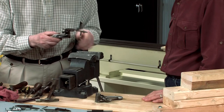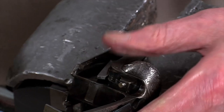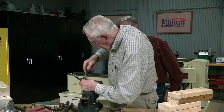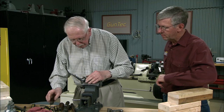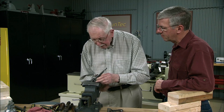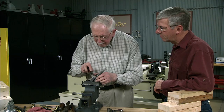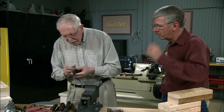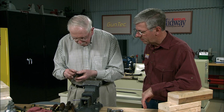Now let's just put in the gas checks which hold those discs. It's best to use a vise because you can easily slip out of these things. And there we go, it's fully up. That side went in a lot easier than it came out. Actually, I think somebody had tried to turn the disc at some time. There we go, that's fully on. Okay, that's the firing pins or strikers in, and both sides push out all right.